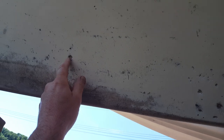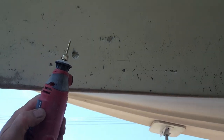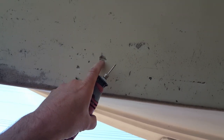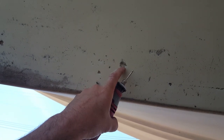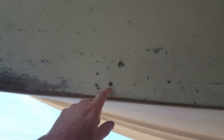We're just getting finished up now. I found a few blisters — very few — but we also have quite a few dings in the hull and other areas that needed to be ground out. I'm using my Dremel tool with a tip, and just like a cavity in a tooth, we're cleaning these up and getting them ready for filling. We're going to fill these with a filler resin, some type of epoxy resin for marine use.